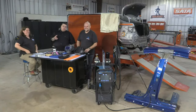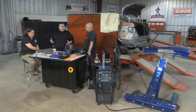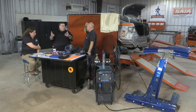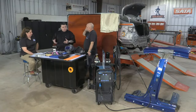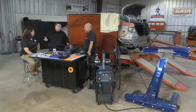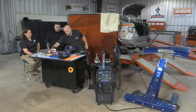So I might have to have two welders set up for silicone bronze, because Volkswagen will allow a Millermatic and a Honda. Volkswagen's big thing is they want you to be able to get parts very quickly in case you need them or service. And this is our requirement. But with Honda and Mercedes-Benz, you might need a pulse welder, which might also be used for welding aluminum in some cases. Which means you might have to switch out gun liners because of what you need.